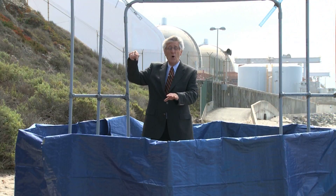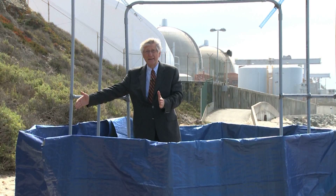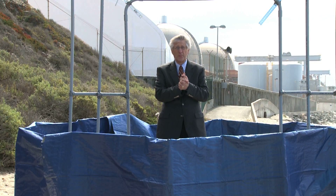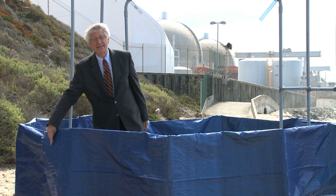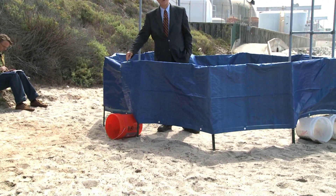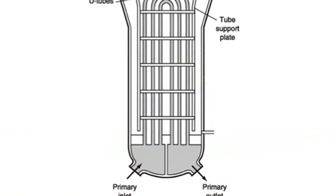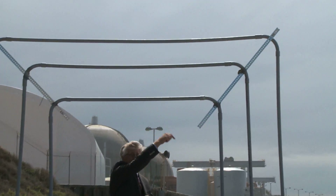The first thing they do is drill holes into this tube sheet. They drilled 9,700 holes on this side and 9,700 holes on the other side. When they put the steam generator together, hot water comes from the nuclear reactor — that's symbolized by this orange pipe. It's actually 32 inches in diameter and a quarter of a million gallons every minute comes in. It comes in the bottom and goes up through these tubes, crosses over and comes down on the other side.